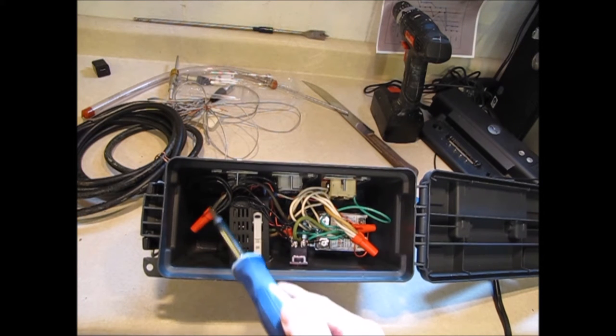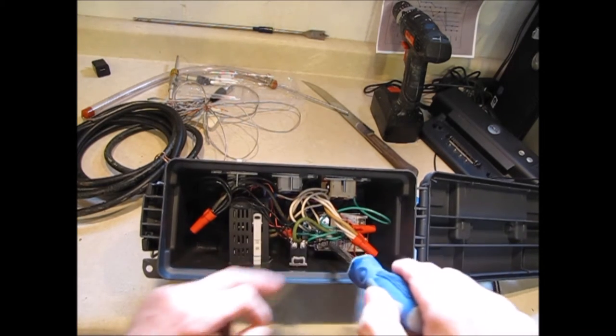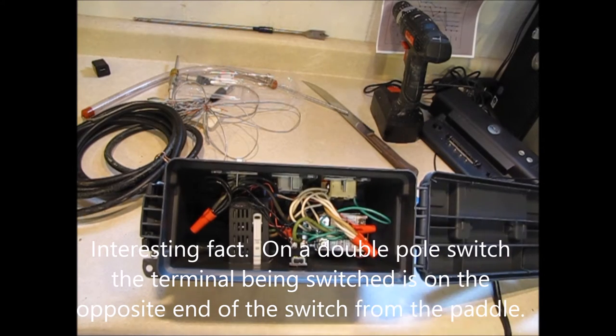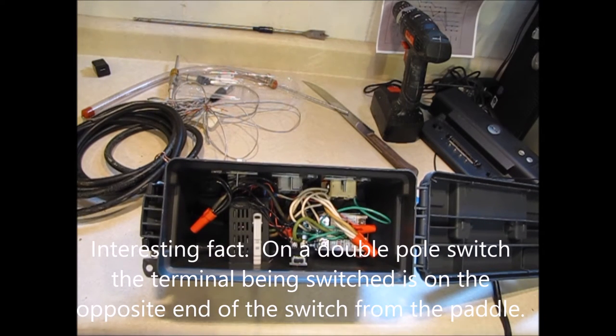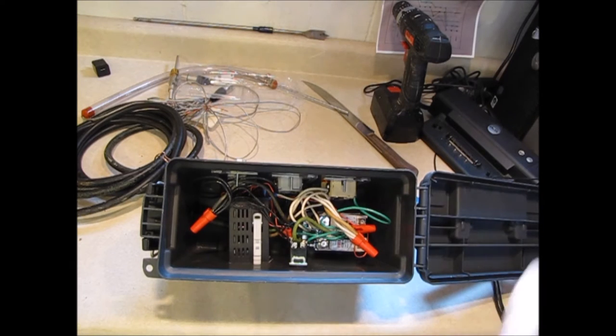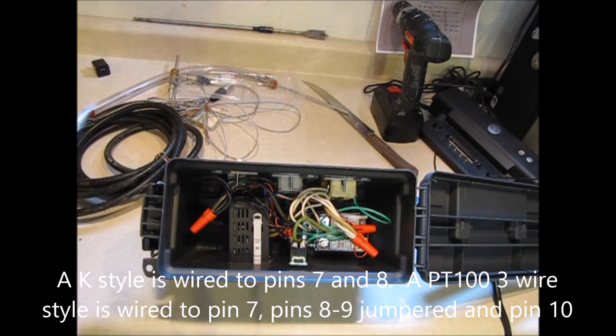Off to the left is my hot wire, netted to the different outlets and to the relay. Solid-state relay on a heat sink. The common wire and ground wire run through there. Looking at the switch, I've actually only got one side of the double-pole being used — one side disconnects the connection and the other side connects it. When using a PT100 style, pins 8 and 9 need to be jumpered across. When using the K-type dial they shouldn't be jumpered, so I disconnect it. PID wiring — just follow the instructions on your PID sheet for how it works with the relay and how it sends power to your outlets.